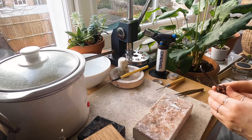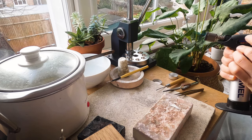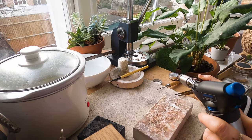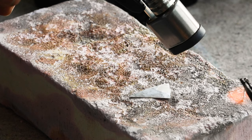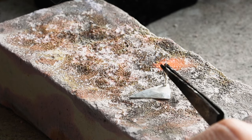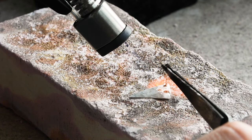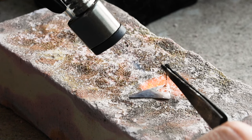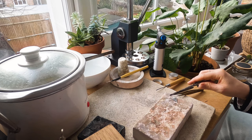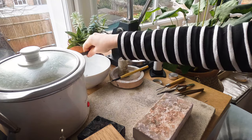Now I'm going to heat this up and pick up that little piece of solder on the bottom of the pin. What you need to do next is quench that in some cold water and then put it in the pickle.